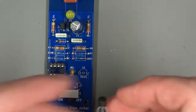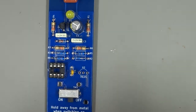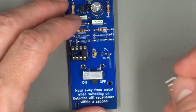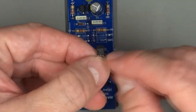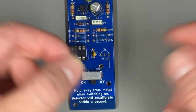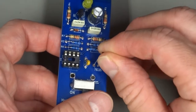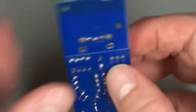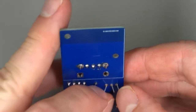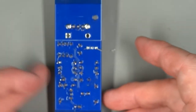And then the one without the stripe is the voltage regulator. We've marked that 78L05. If you do look at the numbers in there, eventually you will find 78L05 written in it. It's got a bunch of other letters and numbers on there also, though. And we can install that the same way.